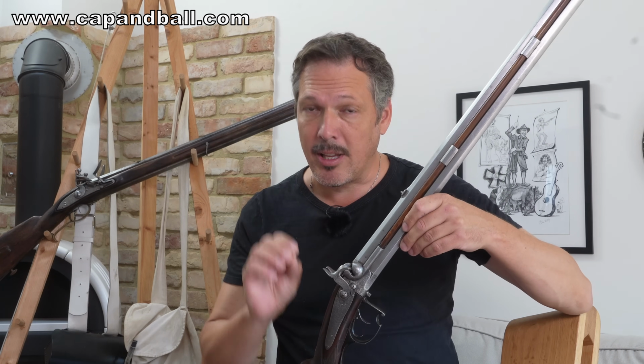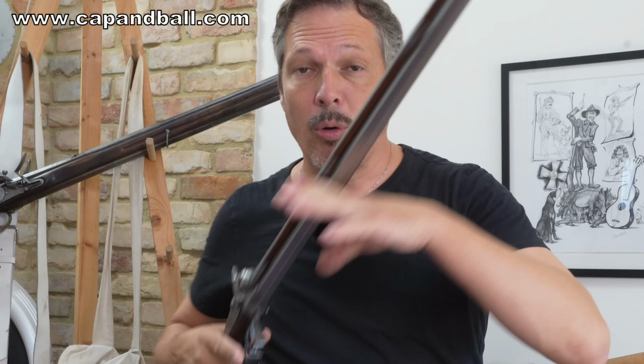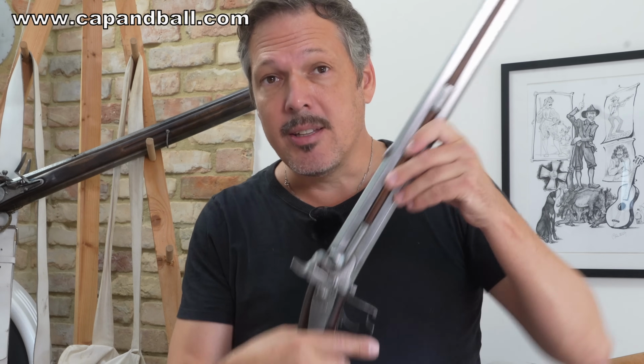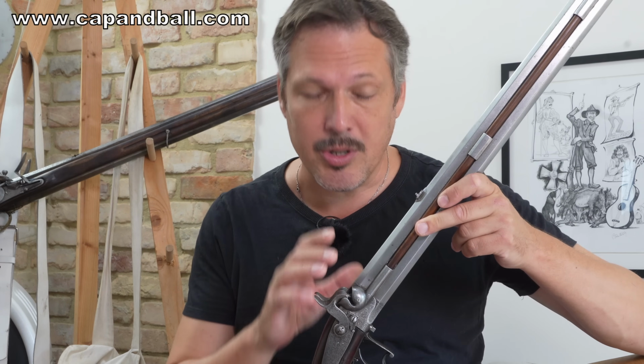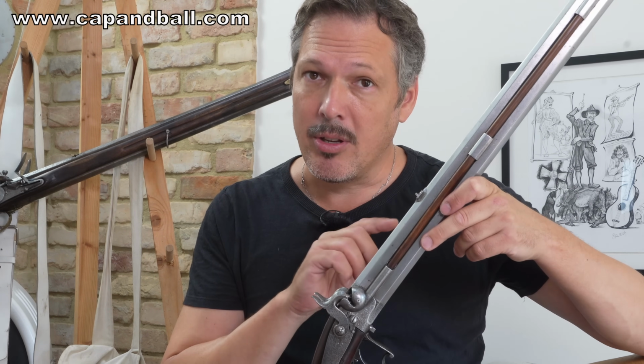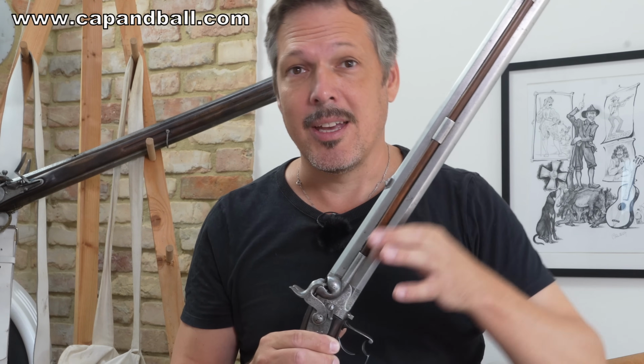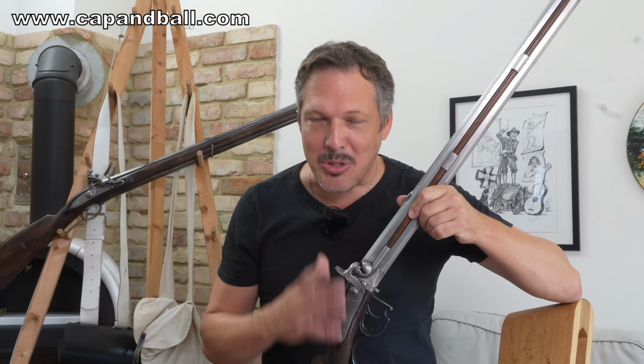Well, this rifle has some very interesting specialties. First of all, this is a double rifle with over and under bores, which is not really common in the 19th century. Germans call it the box system. Second, there is a very special rifling in the bores. The upper bore has a traditional spiral rifling, but with the same number of grooves and same depth of grooves, the bottom bore has a straight rifling. Let's see the story of this lady and let's see how it shoots, of course.